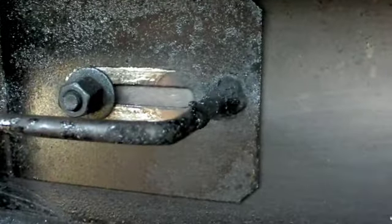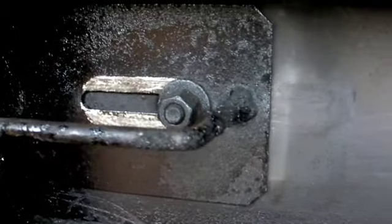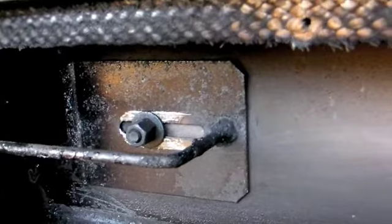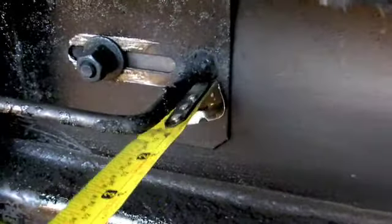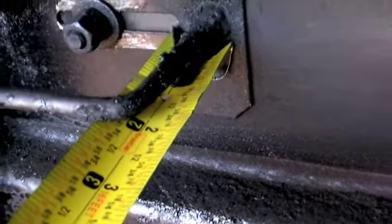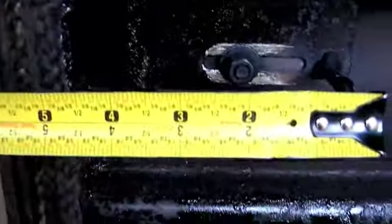This slider — an L-shaped piece fastened right there. The nut is fairly loose. These are the slots on an Eco 60; some of the others may be different. It's basically an L-shaped piece welded onto the existing flapper. It looks like it's about two and three-eighths to the outside of the rod, and the rod goes through — this rod happens to be about seven inches long.